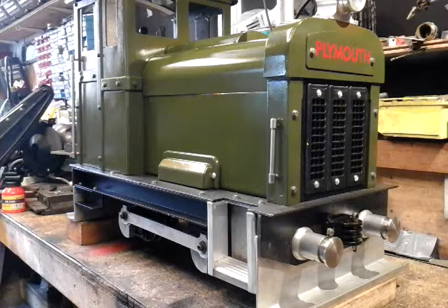Now whether it's just the situation of our track with the gradients, I don't know. Anyway, he suggested going to 24 volts. I didn't want to have to do that, because I didn't want to overload the motors and burn them out. So what I did, I geared it down to 7.5 to 1, and in hindsight that was a little bit of a mistake on my part.